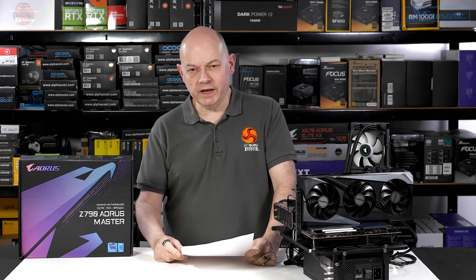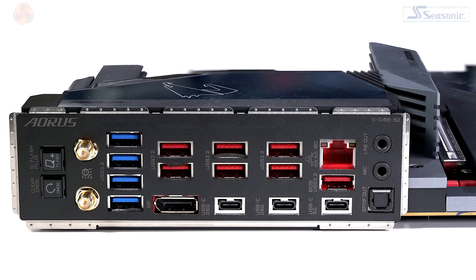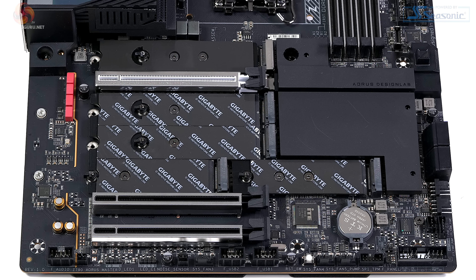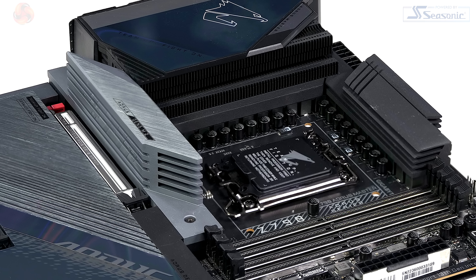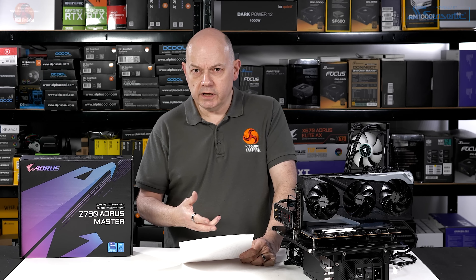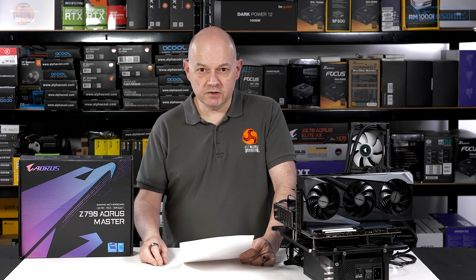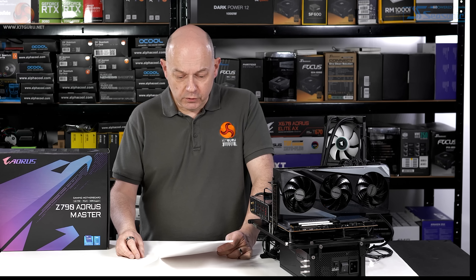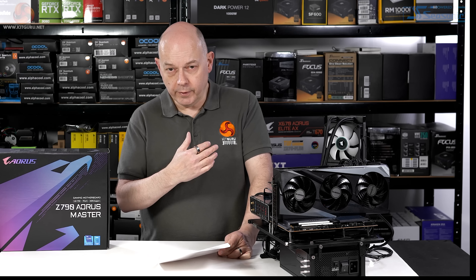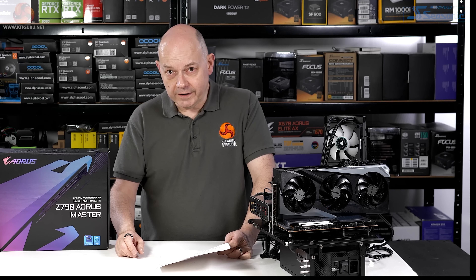My pros and cons. On the pro side: you get a huge number of USB ports, both internal connectors and on the rear I/O panel, including three Type-C connectors — absolutely exemplary. Second, you have five M.2 slots; even discounting the one that clashes slightly with SATA, you've still got four — one Gen 5 and the rest Gen 4, heaps of storage. The VRM is absolutely massive with superb cooling; during benchmarking the VRMs didn't get above 60°C, so they're not the slightest bit stressed. Excellent fan support as well — the number of headers is huge and their layout across the board is excellent, with very good BIOS fan control.